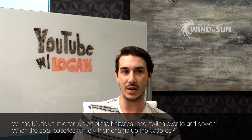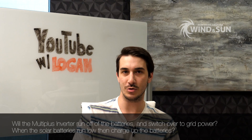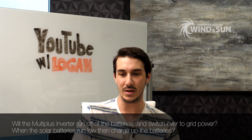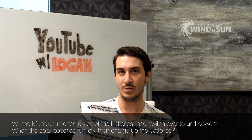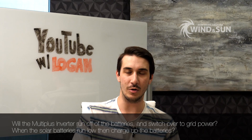The MultiPlus inverters are inverter chargers, so yes, they can charge the batteries from the grid or from a generator. You can set it up so the inverter always uses external AC power anytime it's available — that's most common in an RV system where you want it charging and passing through power anytime you connect to shore power. In a residential application with the AC input connected to the grid, you might want to set it up on a conditional AC input so it's only pulling off the grid when the batteries need it.